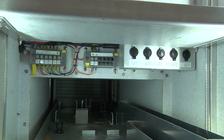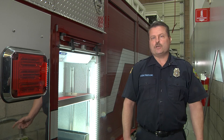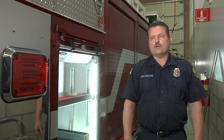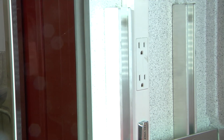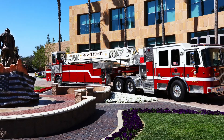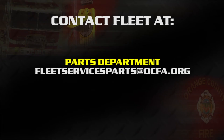All trucks have rechargeable battery packs for rescue devices. While those are charging, try not to overcommit on voltage — minimize what's in that compartment to essential items only. For those battery packs, don't store anything flammable next to them that holds in heat; that causes the battery packs to overheat. Keeping things clear will improve charging and reduce the risk of fire. We also have 12-volt outlets and 110-volt outlets that charge at the station and when the generator is running — make sure we don't overextend the unit.